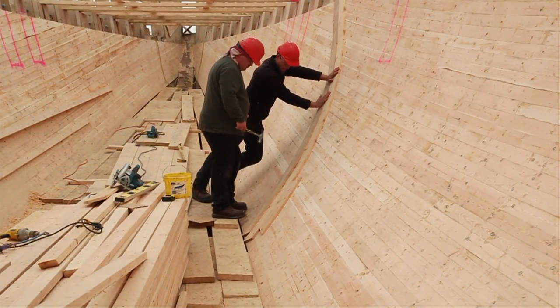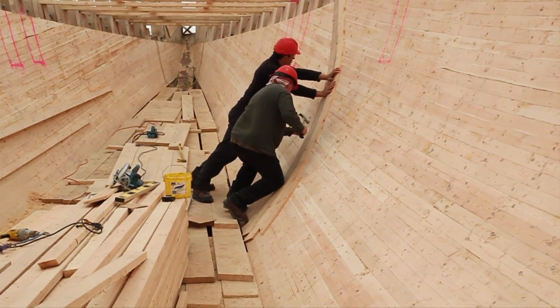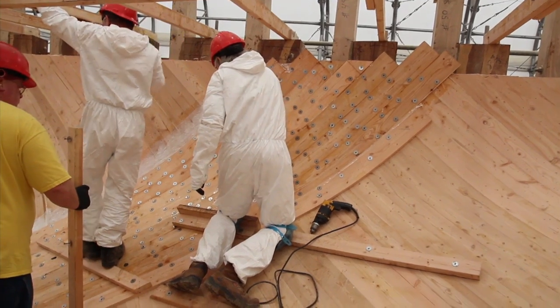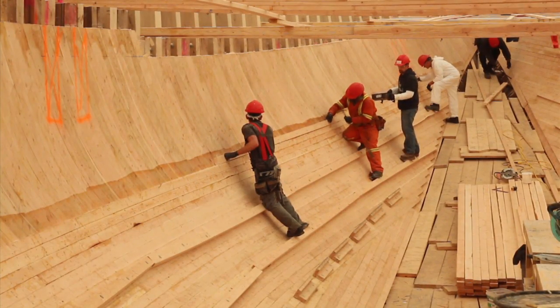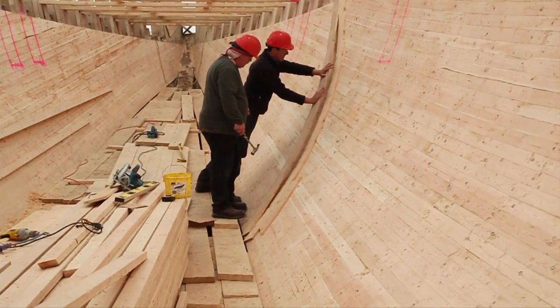The second layer of the ceiling is 3/4 inch Douglas fir. It will be laminated with epoxy to the first ceiling on a diagonal. The third layer, also 3/4 inch, will be laminated to the second on the opposite diagonal, and the final layer, or fourth, 1.5 inches thick, will be horizontal.